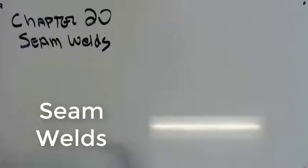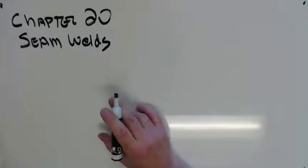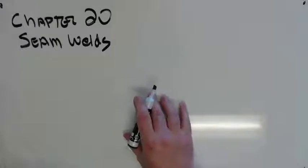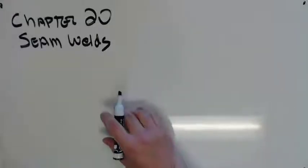So these are not often seen by manual welders, people doing this all day. A few specialized industries do, but it's fairly common in sheet metal manufacturing. A seam weld is a continuous weld made on or between overlapping members. This can be a single long weld or a series of overlapping spot welds. Used to seal sheets in most applications.